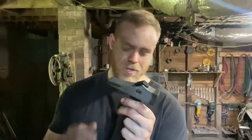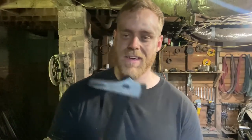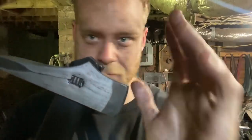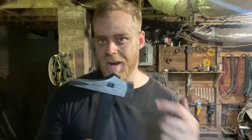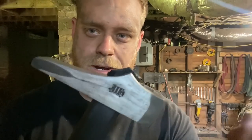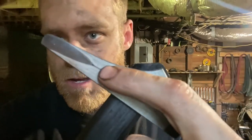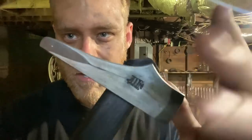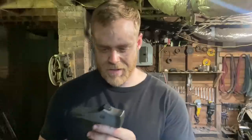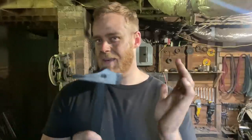If you watch the whole video, you'll see we hit quite a few roadblocks, and I almost thought about scrapping the project after that first face weld didn't take. That being said, I'm really, really happy with how well this one took. It's seamless all the way around, and the fact that it made it through a water quench, there's no doubt in my mind this forge weld is solid. There's a bit of a split in the wrought iron right there. It's to be expected working with the material, and it is kind of fouling up the end of the cleft weld right there, but it's 99% that it's not going to come out of there or anything like that. All in all, I'm really happy this thing turned out.